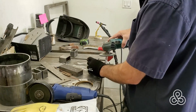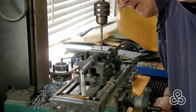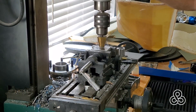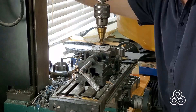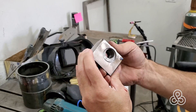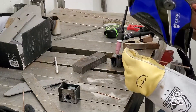Here I'm just cleaning up that rectangular tubing stock and I'm going to also bore a big hole in it, because that piece of bar stock that we drilled out and made tapered is going to fit in here and get welded into this piece. That'll hold it in position into all the sheet metal parts that are going to create this upright. The bar stock drilled out fits in here and we're going to go ahead and weld this thing firmly in place.